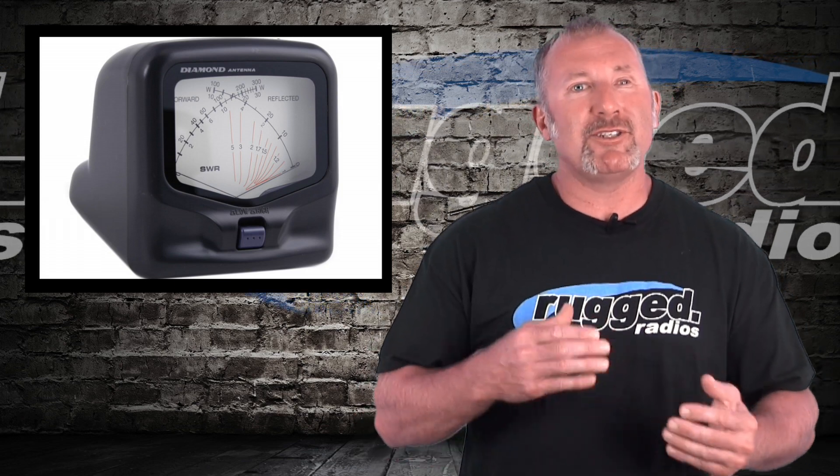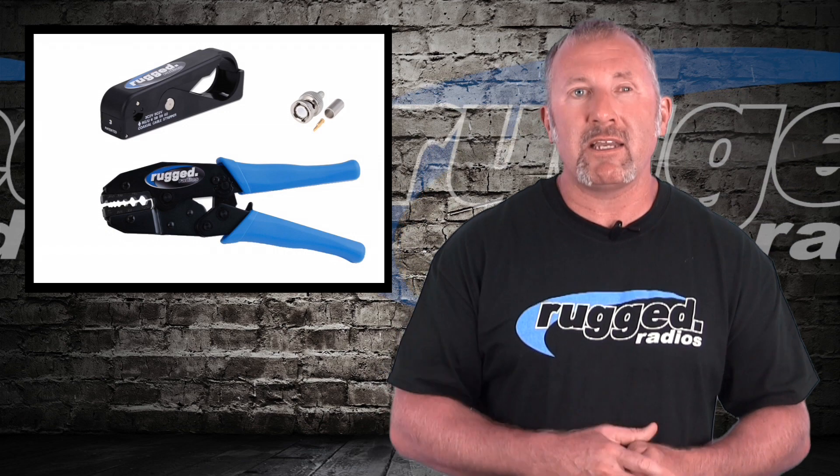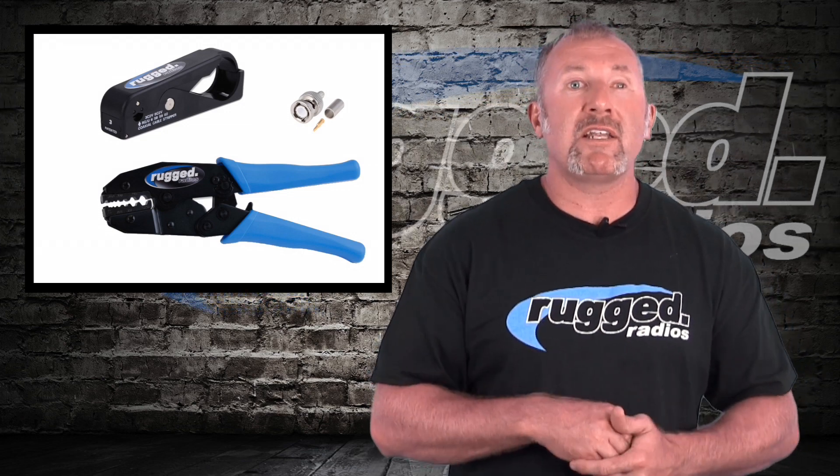One important thing I've learned from personal mistakes: when you cut the antenna to length and put a new connector on, make sure you don't leave any loose wire strands that can short the cable. Take your multimeter and check continuity between the tip of your coax cable and the outer shield. This can also reveal if the cable is smashed and shorted somewhere down the line — a short will ground your radio so when you hit push to talk, you get no range. Make sure you have the right crimpers and strippers. We sell all the parts, or you can send it and have us do it.